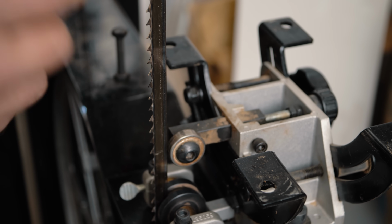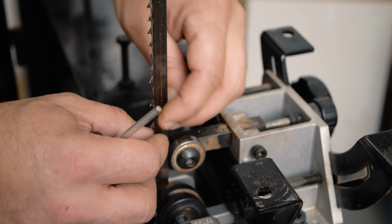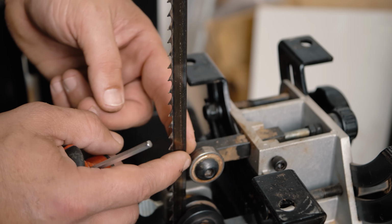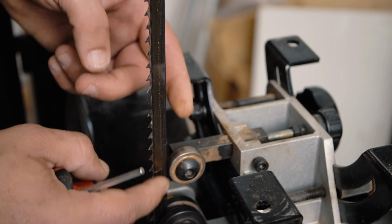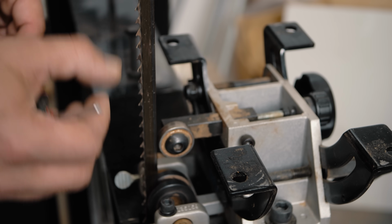So these are like the most important ones because you have the center of the gullets on the wheel. This is like a fishtail. So this part is always gonna track straight, but what can get wonky is this, and so you wanna make sure your thrust bearings are just right about there. And those are absolutely perfect.